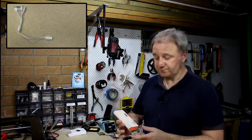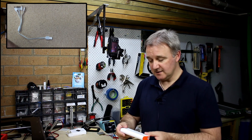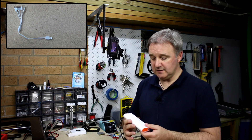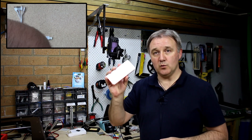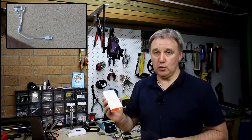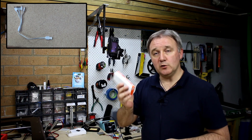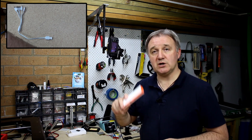Going straight back to the claims — I'm guessing the 50,000 milliamp hours is just not realistic, and we'll look at that in more detail. As for the 1 amp and 2.1 amp outputs — I have doubts. Another interesting thing to note: if you plug in the micro USB to charge, it turns off everything else, so you can't charge and provide power at the same time.